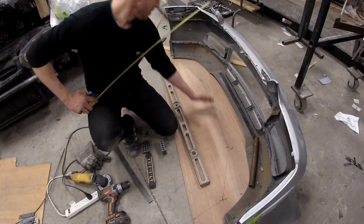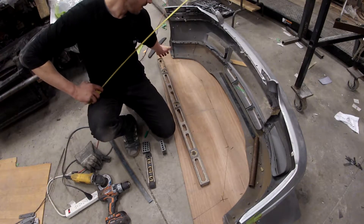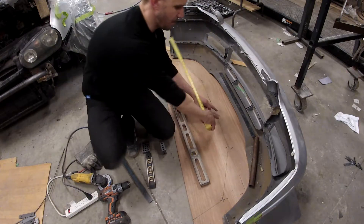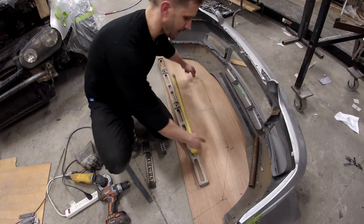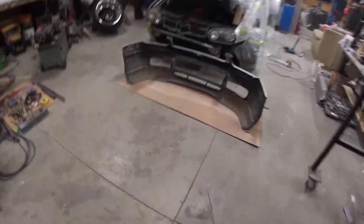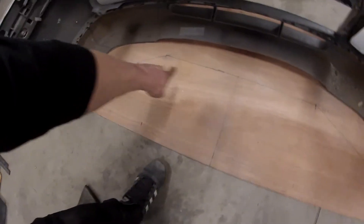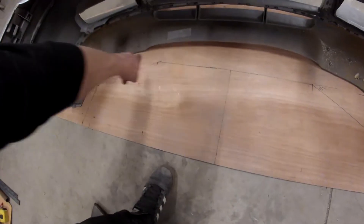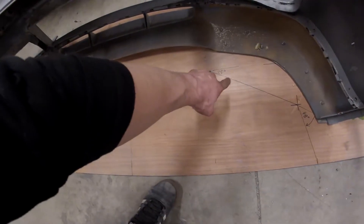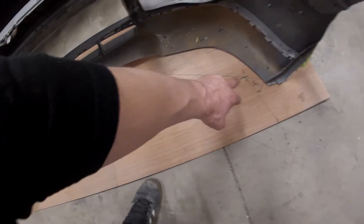I record that in from the bend point to there. After I do that, I duplicate the information on the other side. When we start bending the bar, we start from the middle, then bend one side down and then the other side down. We flip it and go back and forth so everything works out from the middle. Here is the plan laid out: we have 25-1/2 inches from the middle outwards total. We have a 25-degree bend, the first one there, to the second segment there.